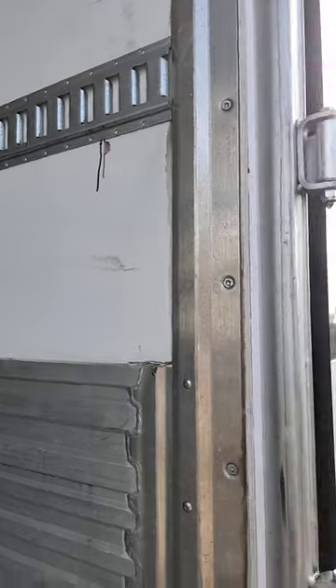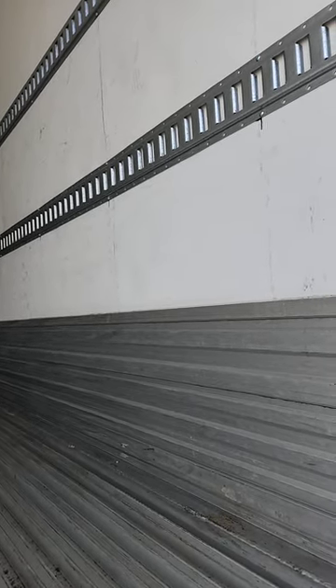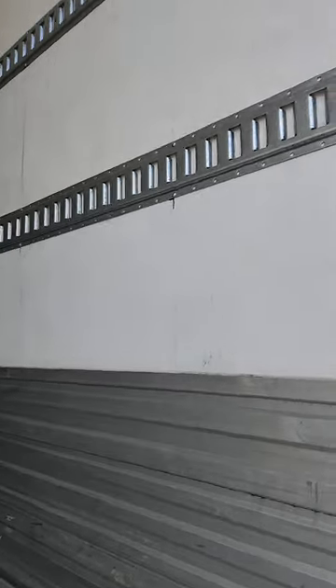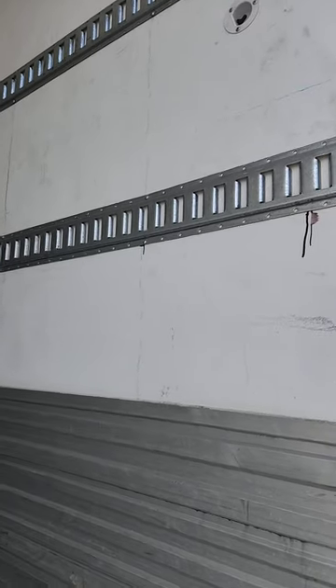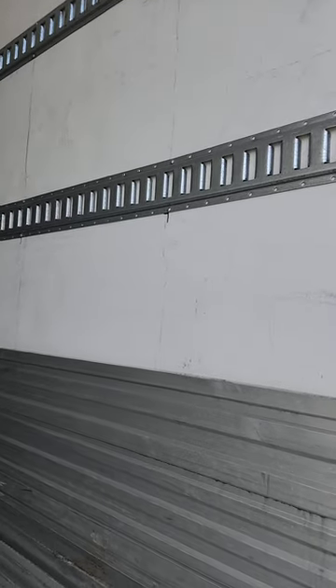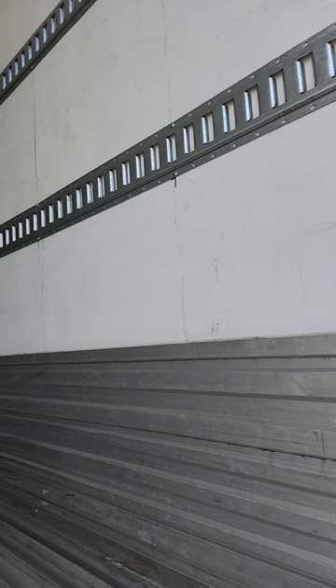I set the bits at the same depth as the screw when drilling, so you don't drill through the outside of the wall — the wall is only about two inches wide. I used a 3/16ths drill bit. That aluminum in there is pretty tough stuff, so you will be breaking bits. We were using Bosch, Irwin, Dewalt — all kinds of different bits and broke every one.